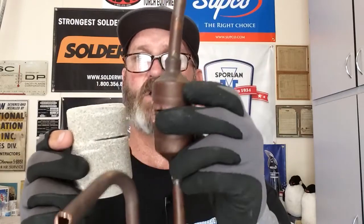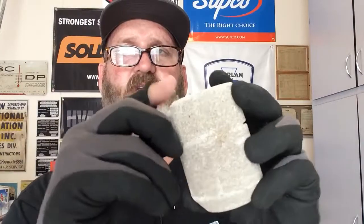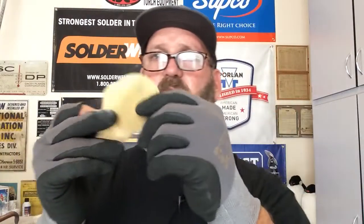If you think this dryer is a muffler and put it in that place, the dryer will break apart. Filter dryers - look at that - they're basically silica sand, very minute sand. It will break apart and go out into your air conditioning system, plugging up your TXVs. All of a sudden you've got a temperature drop, or you'll look at a dryer that's plugged and has a three, four, maybe ten degree drop. In some cases I've seen filter dryers with frost on them - liquid comes in and frost is leaving because it's acting as a TXV because it's so plugged.